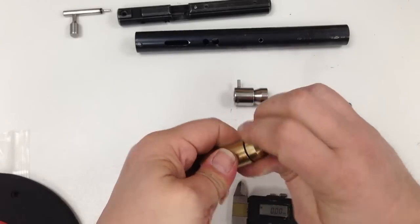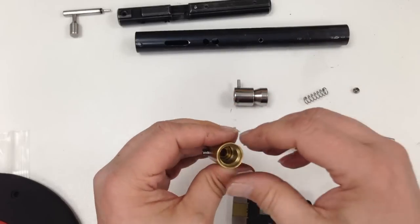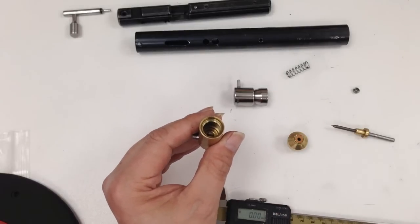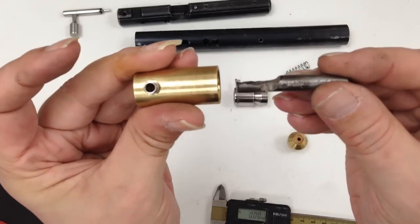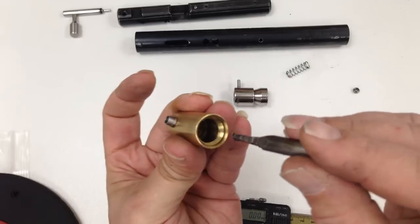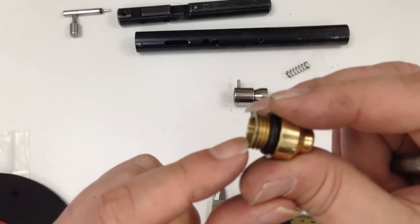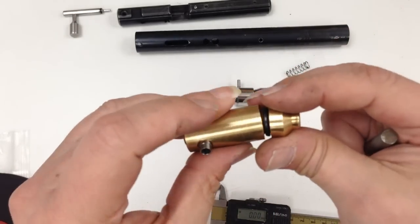Okay, so I will take this apart. I bored out the inner hole larger using a boring out tool. I was lucky to use a lathe, which is more convenient, so it just goes in and bores the hole larger. Leave a few threads behind obviously to lock this in place. I also cut this down to size. I cut off about 2-3 threads, so made it smaller but larger capacity volume inside the chamber of the boss valve.